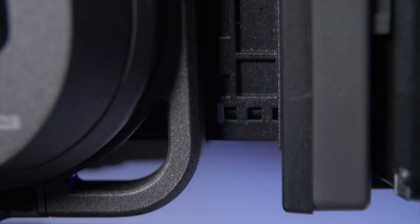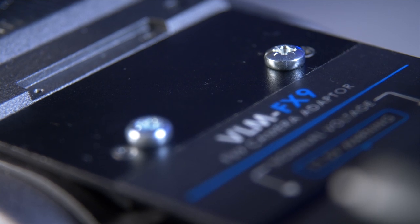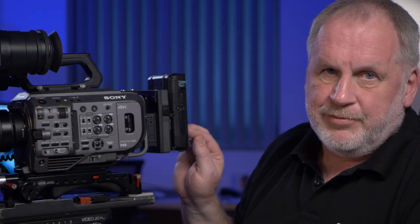It looks like I might not have been the only person rushing. The design of this looks a bit of a mess. It sticks out further than it should, and these nutty little screws on the top don't really suit a 10k camera. It's all a bit bendy so it rattles when it's handheld. Worst of all, if you put on a battery that isn't fully charged, there doesn't seem to be enough juice to kick the regulator into action which steps it up to 19.5 volts — and that's a problem.